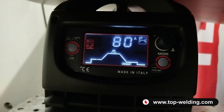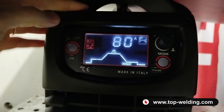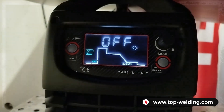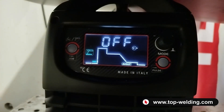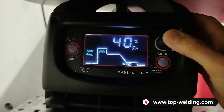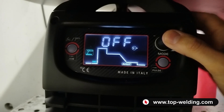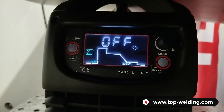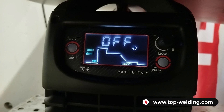I've positioned myself a bit in the shadow so you can clearly see all the functions on the display without any glare. On the left we select the desired welding process — in this case MMA shielded electrode welding — and we use the potentiometer to navigate through the various functions. As the first function, in the bottom left we have the VRD for the voltage at the terminals, which we can activate or not depending on where we are using the welder.